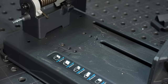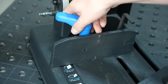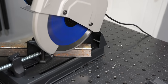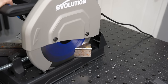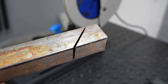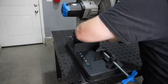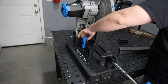With the fence removed, the actual mount for the saw is formed from sheet metal but it's a heavier gauge. There's a stop to control how deep it goes — you can adjust that — plus a lock to hold it down, which is much nicer than a chain I had on a different saw I used to own. There are three different mounting locations for the fence — you can move it forward and back. In the middle position, if I set it to 45 degrees, I bottom out the saw before it makes it all the way through the piece. I generally tend to have the fence towards the front.